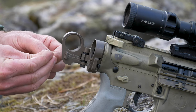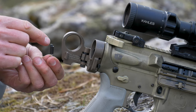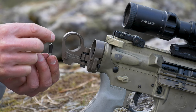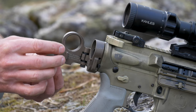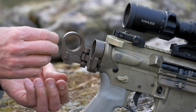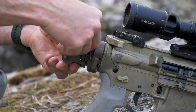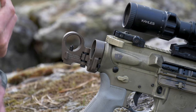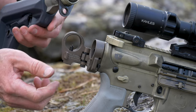At this point we're going to install our new buffer retaining pin as well as the spring that goes with it. The spring is going to push inside — it's relatively captured. There's a scallop section on one side; we want that facing towards the rear of the pistol/rifle, so this blade, since this is open — if it was closed the blade portion would face forward. So with it oriented the right direction, we're going to go ahead and put this spring down in here. Fortunately, the way the spring is made it's more or less captured and probably won't shoot off on you.